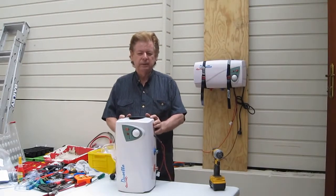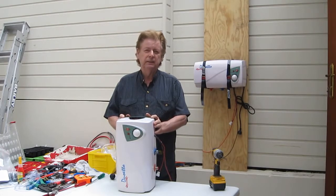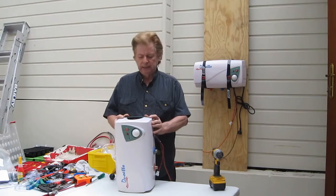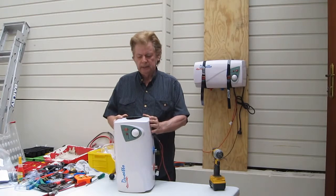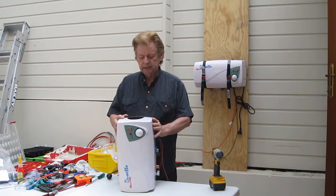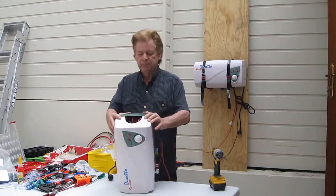In this video we're going to run through some troubleshooting techniques with the Duetto. The first one is the reset button. The reset button protects the 240 volt and the 12 volt side of the heater, and what causes them to be activated is an air pocket or no water in the heater. When this happens, on the 240 volt side this light doesn't activate.